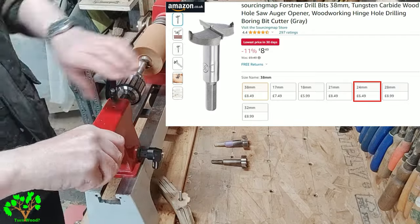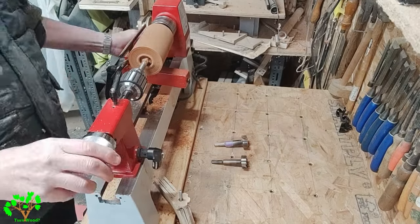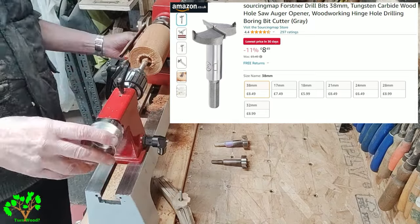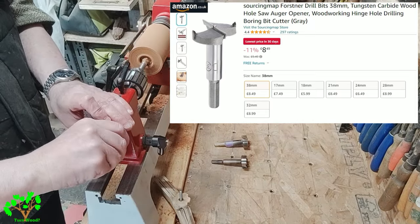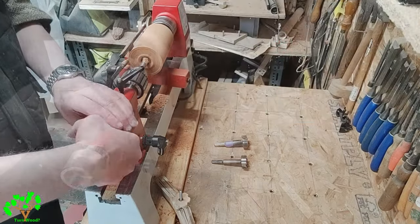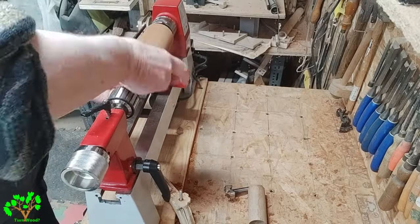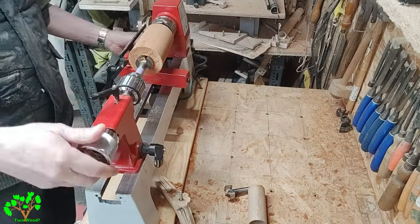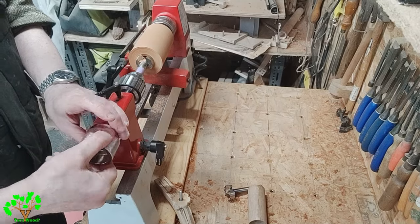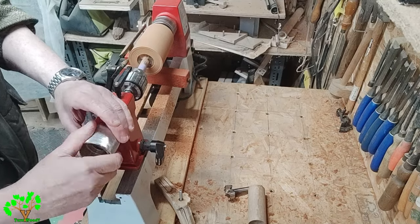Because the lathe is quite underpowered, well, when I say underpowered, it's a 1/3 horsepower motor, which isn't very strong, I need to drill the holes with Forstner bits in two stages, using a smaller Forstner bit first. I'm going to make 5 indexing bushes, so the bores of those bushes have to be consistent. So I use the same procedure in drilling each of the bushes independently, using the same Forstner bits.